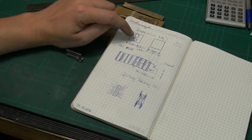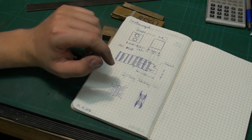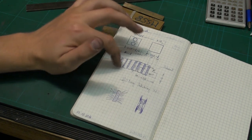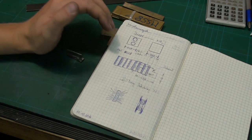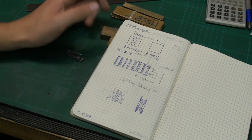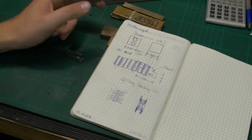But right now, as I think of it, I think we are going to go with one magnet, not with two, because there won't be much meat left to the side to square up this block, which you have to do after some time, because everything on these magnets is soft and they will get dinged up. Yeah, we are surfacing them at work pretty much every year to get them back in spec.